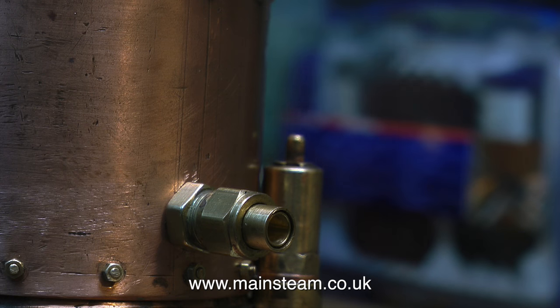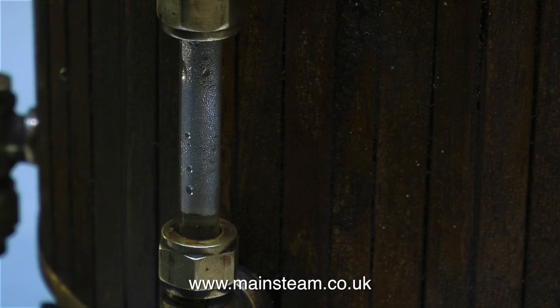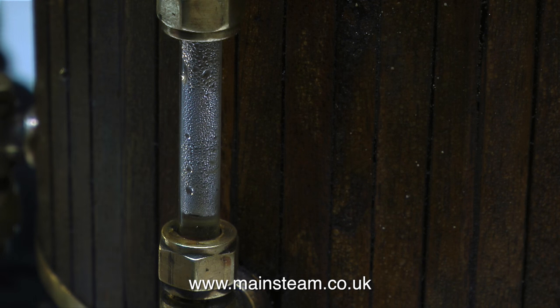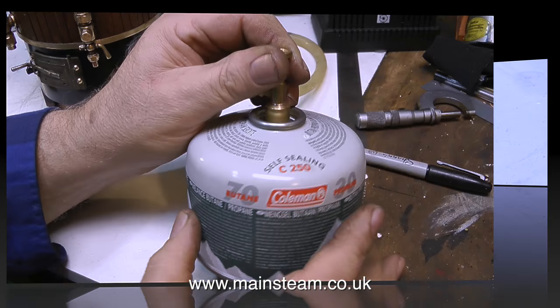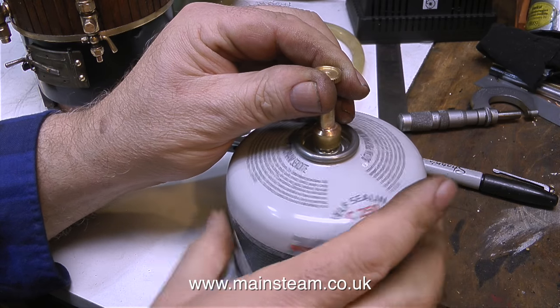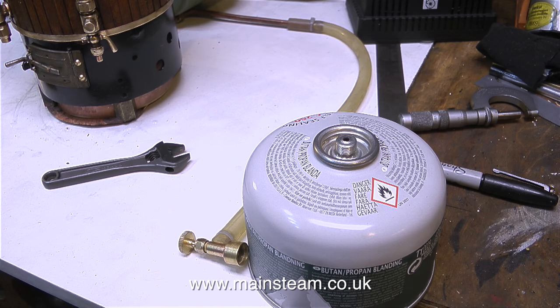When the boiler's fully cooled down tomorrow, I'm going to remove the safety valve and dismantle it and have a look at its internal components — maybe it just needs a new spring. The boiler's water level is getting far too low far too quickly because the safety valve is blowing off for an excessive length of time. If the existing safety valve is no longer serviceable, it's a very important part on a boiler, so I'll fit a new one. And finally, a health and safety notice: always unscrew the gas tap from the gas canister when you finish playing with your boiler. Thanks for watching, and I hope you found it useful.